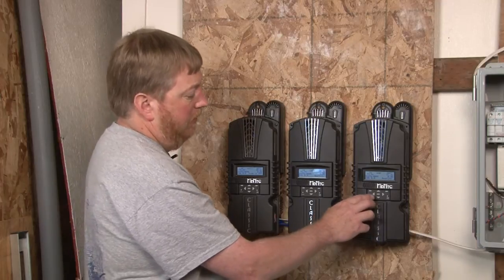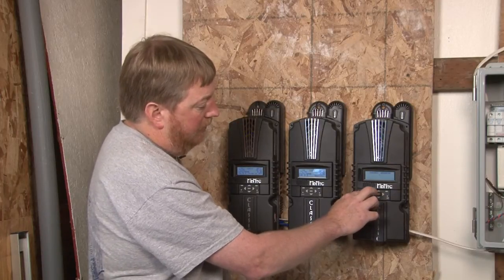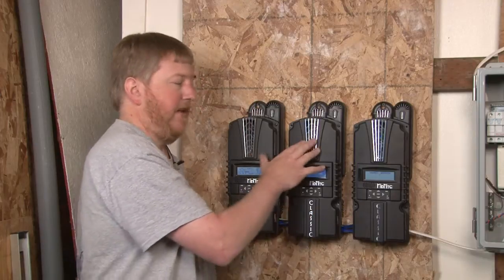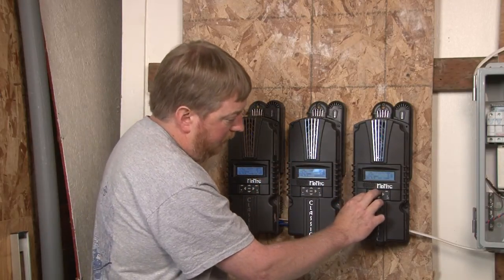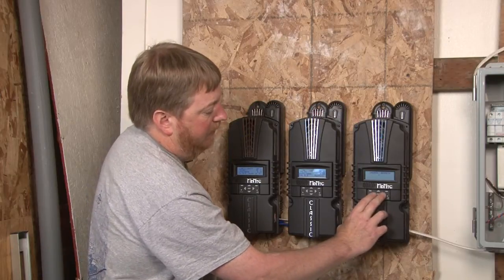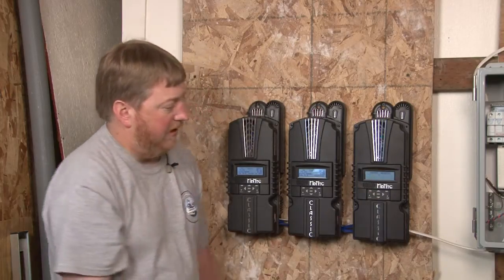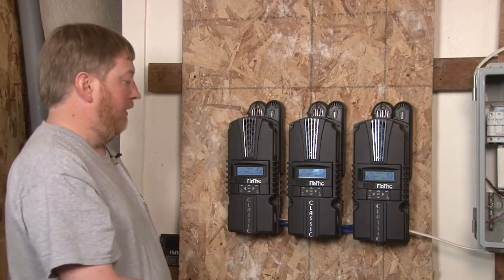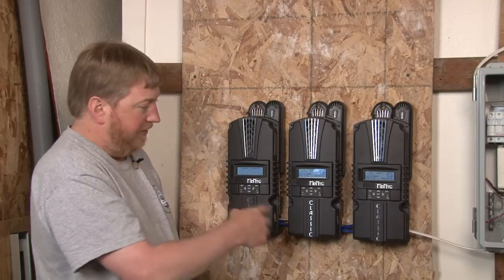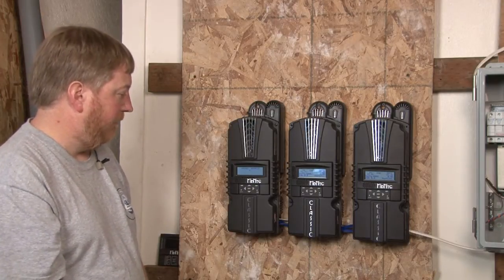So to address this Classic, hold the left arrow and move up or down in numbers. Address 10 is the default address for all Classics. You can set each Classic to a different address — 10, 11, 12 if you will. Let's go ahead and set this one for 11. Now we've got it on unused address 11, so we're going to hold the left and right arrow buttons until it tells us the address is now 11. It's reacquiring with the Classic and the display has come back up. Now this one, which is looking at address 10, we can hold the left arrow and go up to 11. It's going to go through the Follow Me network and ask that Classic to talk, and in just a second it will come up and show that Classic — and there you go. Now this display is actually talking to this Classic through the network.